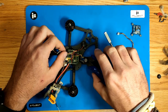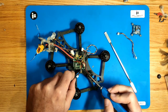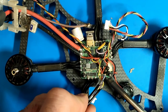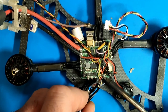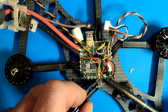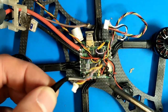If you're absolutely unable to desolder the wires from the analog VTX, just cut them off. But the better way would always be to desolder those wires. There's one side with the VTX — there should be 3 wires: one positive red, one negative black, and one signal wire yellow.